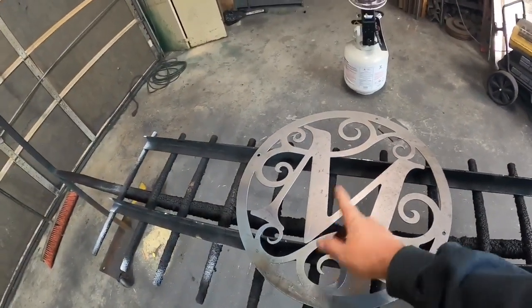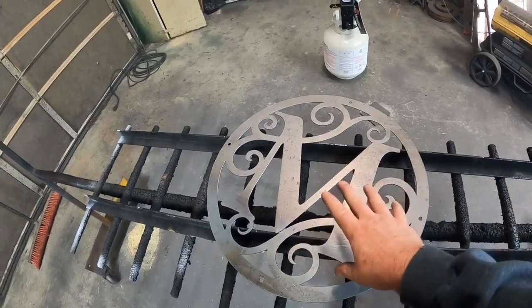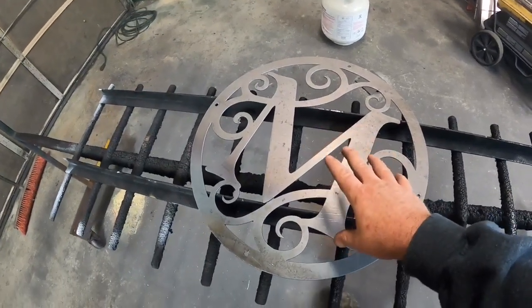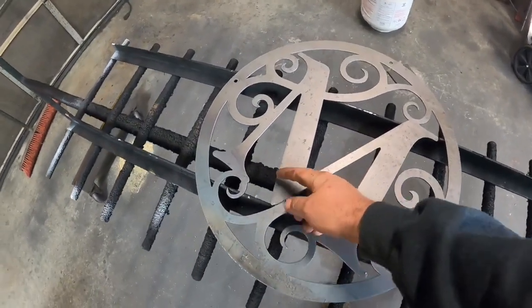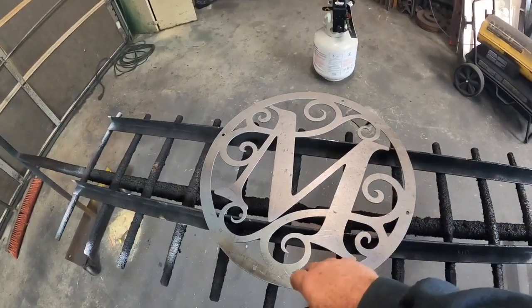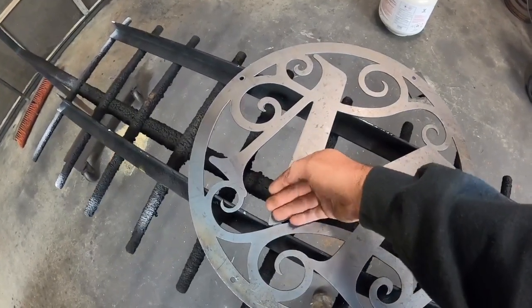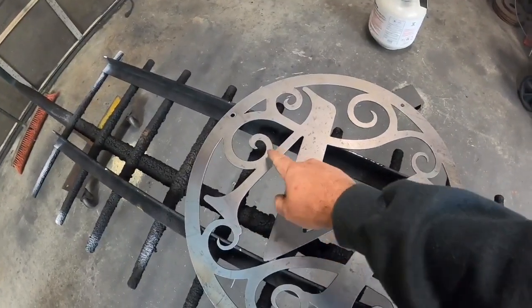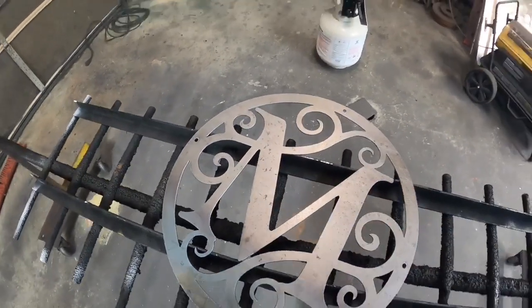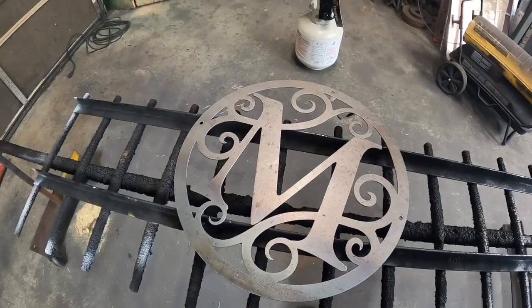You guys seen the tip ups, everything else. You really have to watch this stuff when you're cutting the new pieces, parts, everything else. I mean, it only takes one little part to tip up there and ruin the whole sign. So one little part could have tipped up, the torch could have hit it, and then it would have been off on its next cut, and which always makes it, I tell you what, it always makes it difficult.